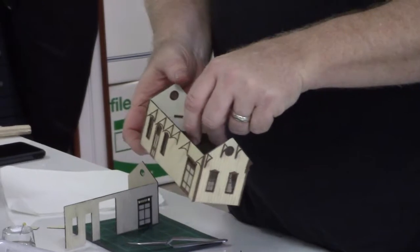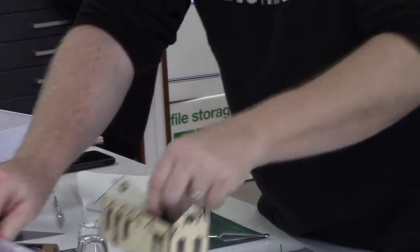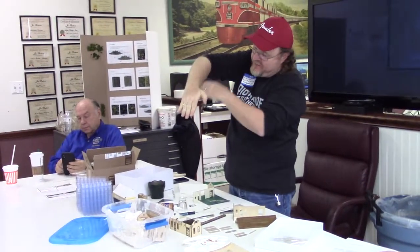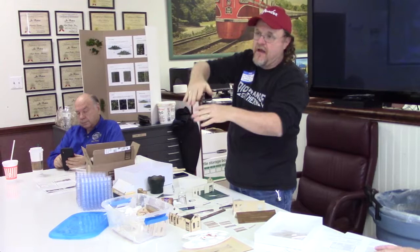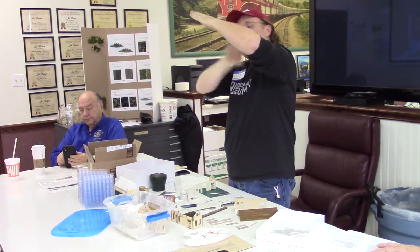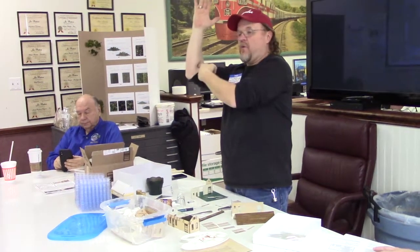They would have been on the rafter ends. Not necessarily. A lot of those would go in. You would have your rafters come out. The tails would come out. They'd have a board across the bottom of that, and then those are nailed up. Usually on the bottom of the rafter you'd have a board. They'd have them supporting on the end of the rafter and then supported up against the wall.